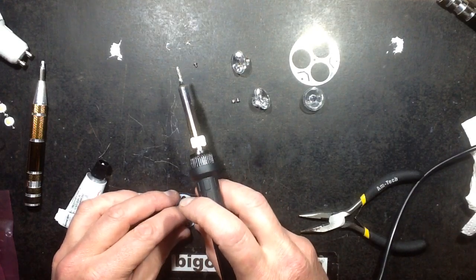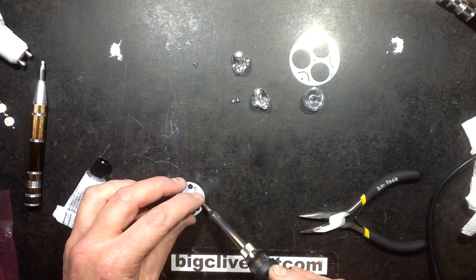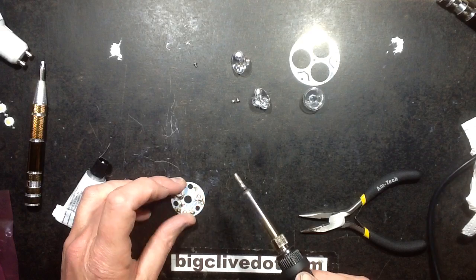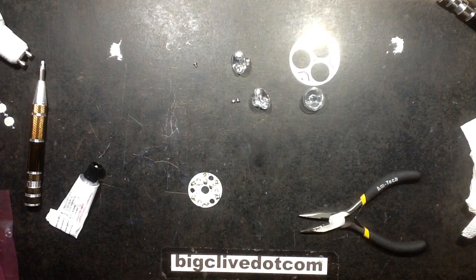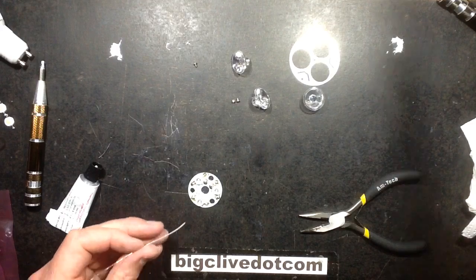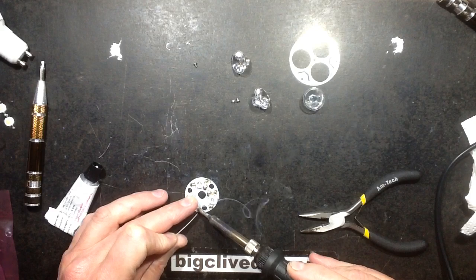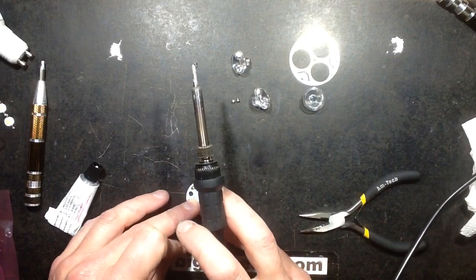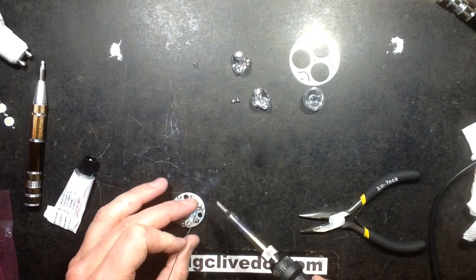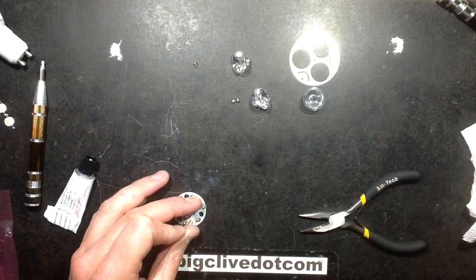It's so easy to move it just as you're actually soldering it, or even positioning it. Let's just try and settle that down a bit. This looks good. So a bit more solder, a bit more solder. I've run out of solder, one moment. So I'm going to press this down and flow this side, and then go and give the other side a wee zap again. And theoretically, that should be my new cyan LED with one green chip and two blue chips.